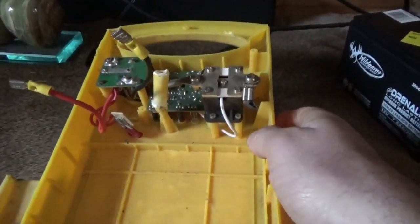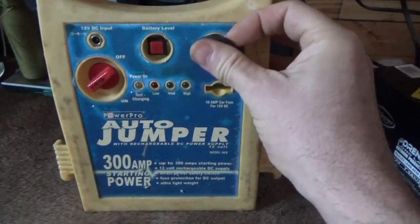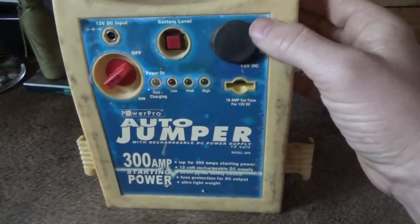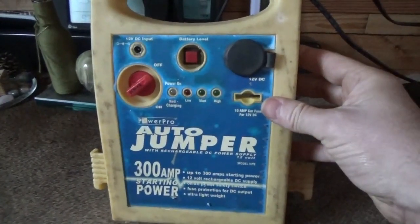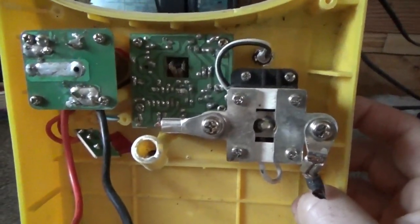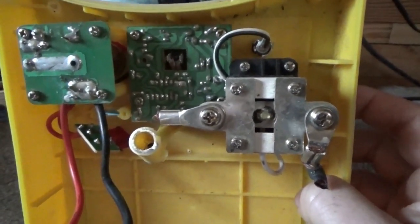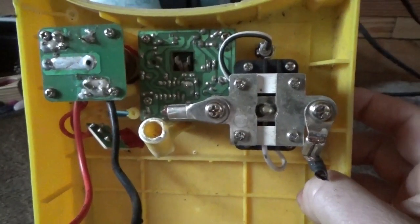There is some great usable stuff in here. It is fused and has a 12-volt power outlet, which is great for off-grid homesteads or camping — throw it in the back of the truck with a battery and you have a 12-volt power outlet. Some have a USB port or power inverter too. On the back there's a battery charging and maintainer circuit — all you do is plug in the battery, apply power, and it's an automatic charging system. If you get these for free, you're saving yourself about fifty dollars compared to buying a battery maintainer.